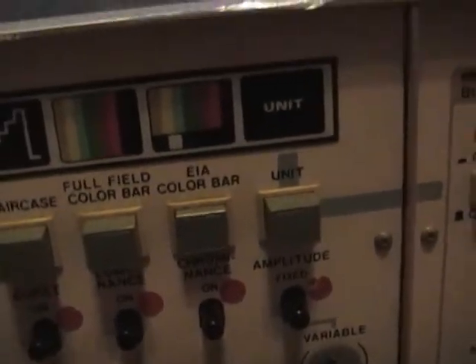I'm really happy to have this because now I can adjust my vintage sets far more precisely. Another fun thing you can do on color sets is they have individual controls for red, green, and blue to turn the guns off. Here's the test pattern — I can turn the green gun off, here's the blue gun off, and here's the red gun off. Turn them all off and you get a bunch of black bars.